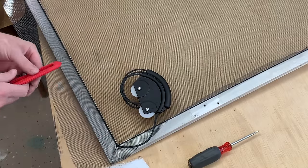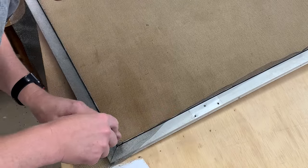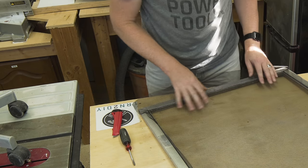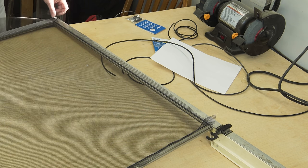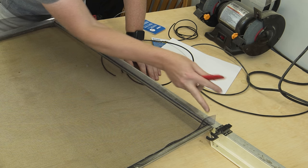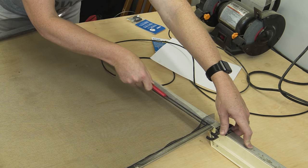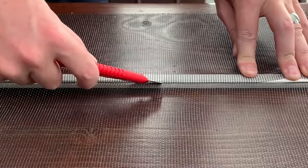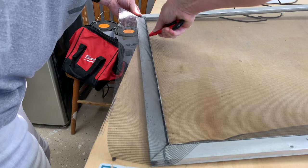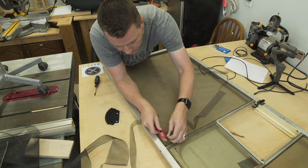When you get to the end of your section, just use your sharp blade and slice off that spline, then use the screwdriver to put those last pieces in place. Now I've got a nice screen — nice and taut. The last thing we have to do is remove the excess, and this goes pretty easily. You're going to run at a 45-degree angle on the back side or the outside of your spline, going up against the middle groove like so. Keep your hands out of the way, and this fiberglass should cut pretty easy — even the aluminum should cut okay.